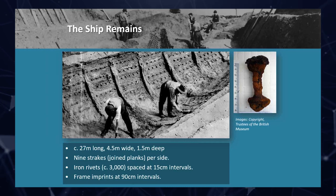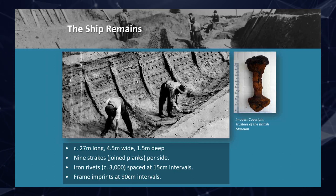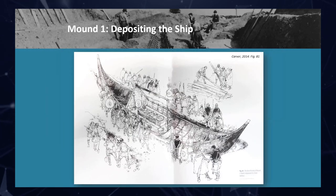The vessel itself is a whopper: 27 metres long, nearly four and a half metres wide and a metre and a half deep. But it is just a big open boat — supersized. It's just nine clinker strakes per side, fastened together with over 3,000 iron rivets. Think of your traditional Viking ship way of building, just 300 years earlier. The frame imprints are all in there at 90-centimetre intervals. And this 90-centimetre interval is pretty much what you get on all rowing vessels throughout history where you're stacking people behind each other — it's just a number that works with the human body. You see it on Roman ships, Byzantine ships, Viking ships.